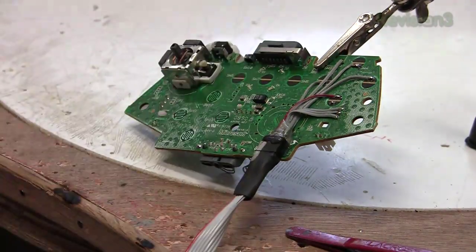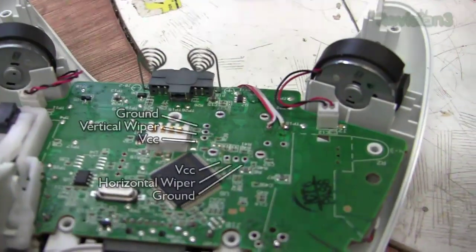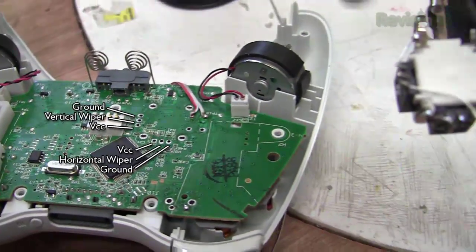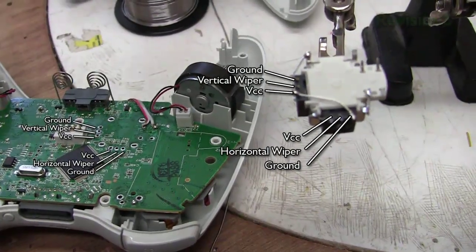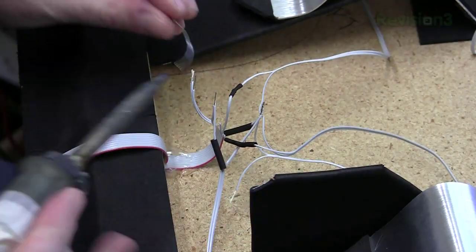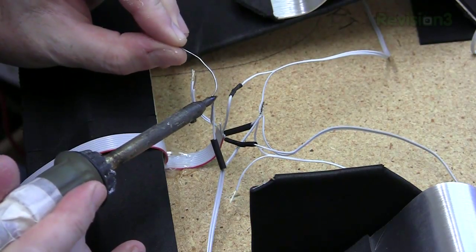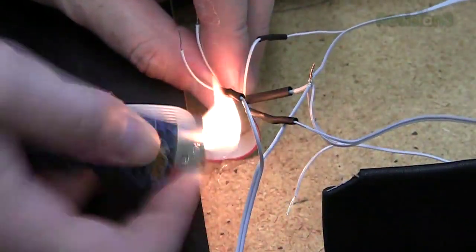Here's where the switch is plugged into the controller so you can detach it with ease. There's also another button here for the left bumper. We're changing the position of the analog sticks, so we've got to make sure all the pinouts are the same. You've got ground, wiper, and VCC for each of the directions — up, down, X, and Y. Then we just solder all the connections in place and use some heat shrink tubing to keep it isolated.